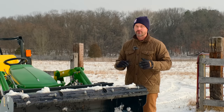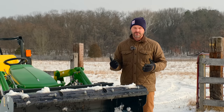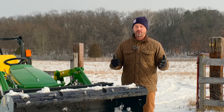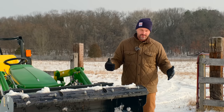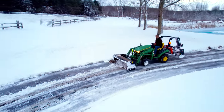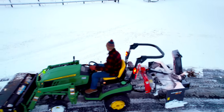They're just so versatile. And that's the difference between a plow and a pusher: you can do a long driveway with either one, and you're going to have windrows left over with either tool as well. The difference with a pusher is that those cleanup passes with the windrows stay trapped inside the pusher. Whereas with a plow, you're just constantly pushing a windrow over and over until it's cleared off the driveway — that's really annoying. So it just makes it more efficient with a pusher to tackle those cleanup passes.